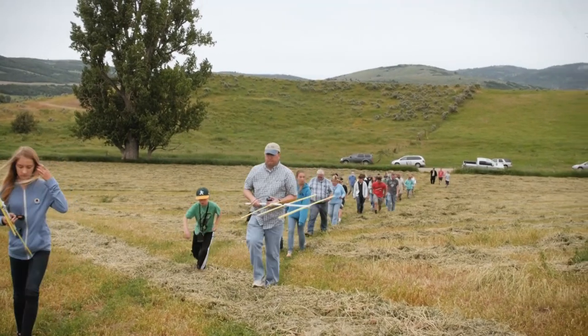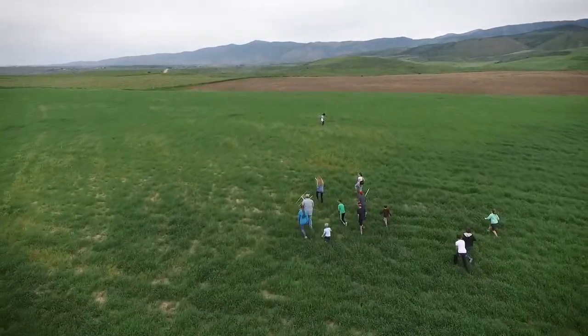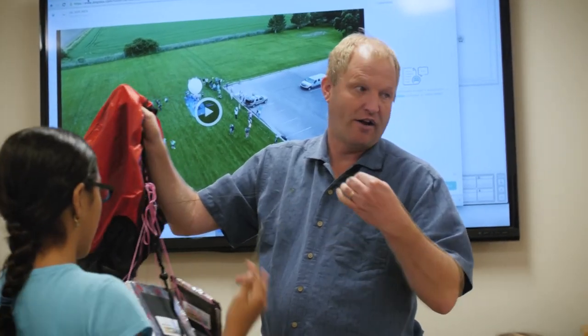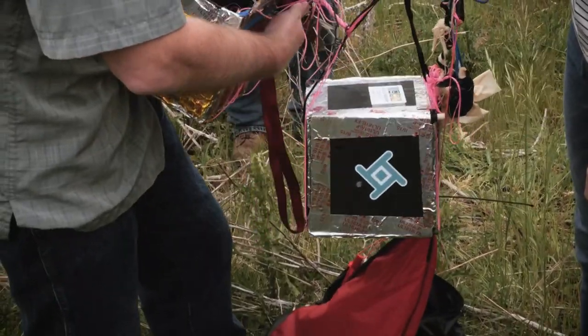We got to the landing site and used our direction-finding antennas to narrow in on it. We found it, but when we opened up the payloads we realized there was a problem — a few things went wrong. Our camera got knocked out of place, and our sensors didn't work because they also got knocked out of place, so we only have pressure as our data. The improvements for the next launch: the parachute was all tangled up between the two packages, and we hit 95 mile-per-hour winds up in the jet stream, so those boxes got tossed around. We're going to look into that, and also work on securing the SD card in the package and building something to protect it so it doesn't come out. We'll also look at our payloads again.